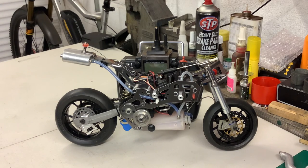What I managed to do was find some small thrust races. Behind the adapter that bolts the flywheel on I've put a thrust race, and I've made various little shims to shim the flywheel out. With the thrust race now, as you push against it it's lovely and smooth. I put a video on YouTube of it actually running — it starts first time now and doesn't bind up because of the thrust bearing. The gear mesh is quite good on the two-speed, so everything there is working well.